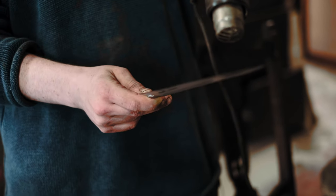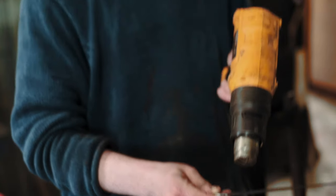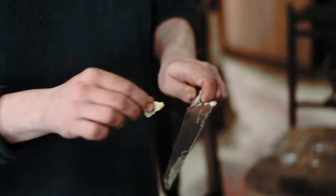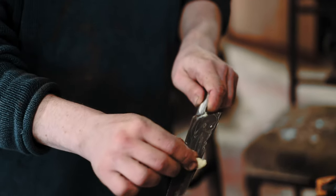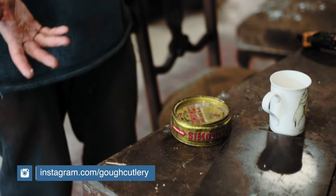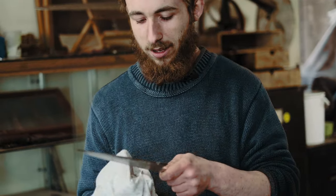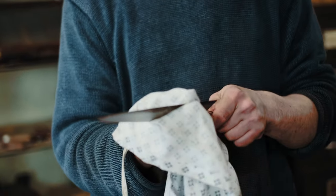If your t-shirt's dirty, don't do that because you'll have bits of grit in it. Once the blade is dry and also warmed up — which helps the wax to stick — just rub the wax all over. Remember to get the spine and choil. Then take a clean cloth and remove all of the excess wax. Make sure to do it before it dries, otherwise it does not come off — read the instructions for your specific wax. Make sure the bit of cloth you're using is clean; you don't want bits of grit in your cloth. And always make sure your fingers are travelling away from the edge of the blade — my hand is always moving up in relation to the blade, never down, otherwise you might end up cutting against your finger.